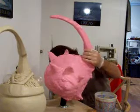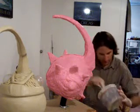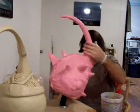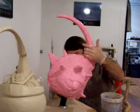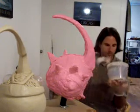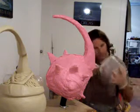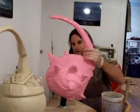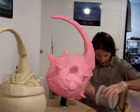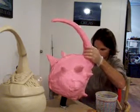One thing I did want to do is get a nice thick coat at the base, where my silicone rubber is the thinnest. This stuff is starting to get a little harder to trowel out, so it's coming near the end of its pot life. There's very little heat coming from the bucket now. But I do want to get as much of this stuff on there as I can because I don't want to waste it. Half inch to three-eighths is a good thickness gauge for a mother mold.